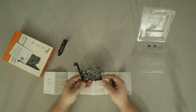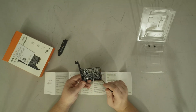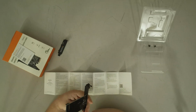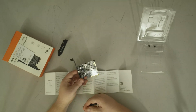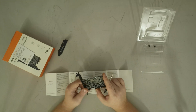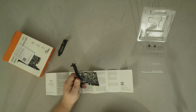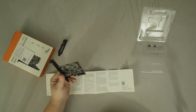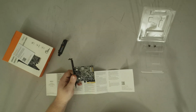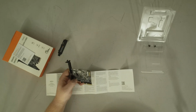And the cost of customizing your PCB to cut out some of these test points versus just building it as is might not work out. I mean, you'd have to reevaluate the whole design, whereas this one should just work if you build it the way they tell you to. And then you have to make a PCB that's just yours. If this is a reference one, you may be able to get it cheaper. You may be able to say, hey, I need 10,000 of these and get it a lot quicker than, oh, here's a new design that you've never made before. I need 10,000 of them.